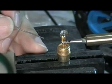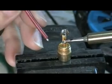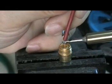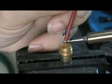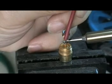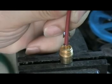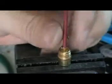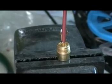You can see the liquid warming while heating it up — it's okay, it won't melt. You also heat up the wire. Once both the wire and connector are hot, then you submerge the wire in. See? Very clean, no cold solder. This is how I did it with this bullet connector.